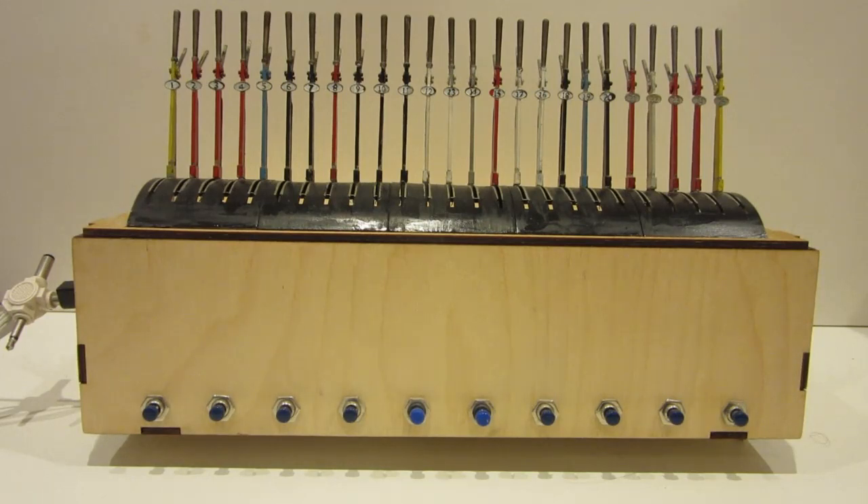What I have done with this lever frame to make it interlocked is that each lever terminates in a little tab which then passes through the head of a servo. The servo is turned to either give a channel for the tongue to move through the slot, or to block that tab from moving so that it locks the lever.